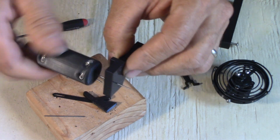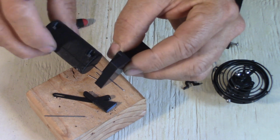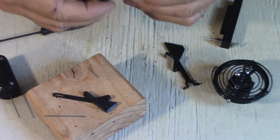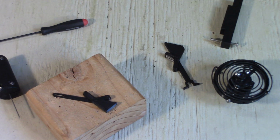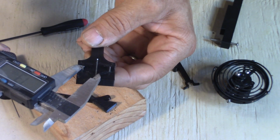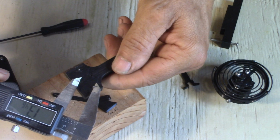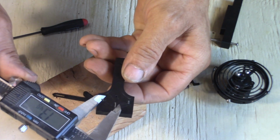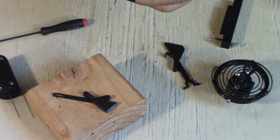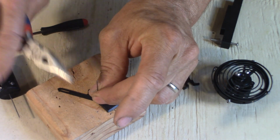So make sure those holes are slightly, that it's quite easy to put the pin in. And then a check. Make sure the tool is good. I'm going to measure. Make sure I have all the same dimension on one side and on the other side. Tells me that the pins are parallel. So then I can start putting this.